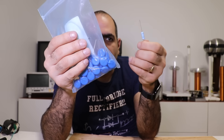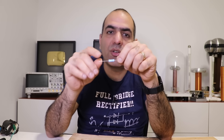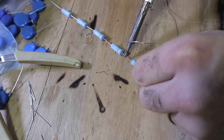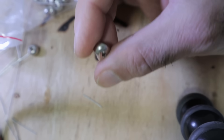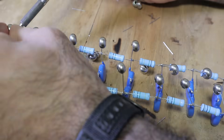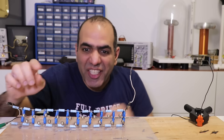In addition to my high voltage capacitors, I bought some high power large one megaohm resistors. Not for their power though — just that the resistor legs have to be spaced far enough, otherwise the high voltage will arc across the resistor, which we don't want. Let's put them together. I have these nice round thingies I want to use for my spark gaps — these things are used on curtain rod fittings. I solder them to a pin like this. Here's my Marx generator ready to run.